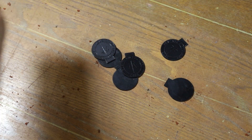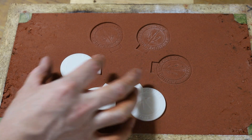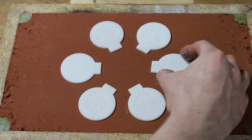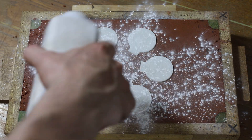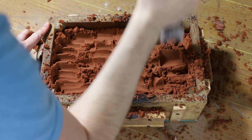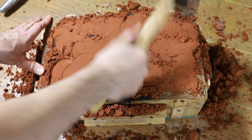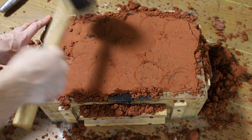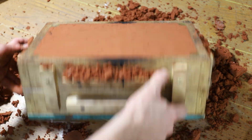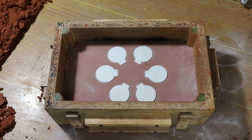This left an impression half the thickness of the resin coin patterns, which I replaced the half patterns with. Then I rammed up the cope like I would normally using baby powder as a parting compound. I flipped the whole flask over and removed the drag, leaving the patterns inside the cope. Then I removed the sand from the drag, placed it back onto the cope, and rammed it up again.